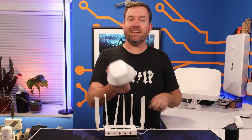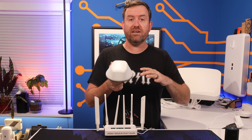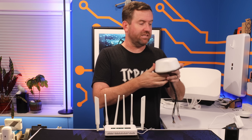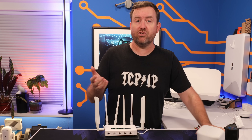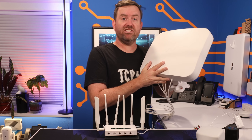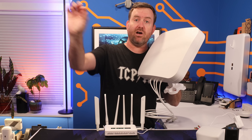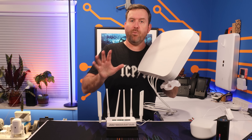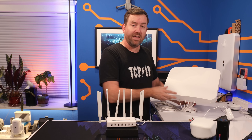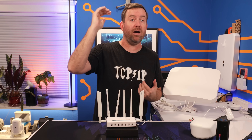This is an omnidirectional antenna. Omnidirectional antennas are great because they can pick up signals regardless of orientation, which is ideal for RVs and vehicles. But for fixed locations like a cabin or a construction site, you might also consider a directional antenna such as this Waveform Quad Pro, which offers greater range because it can focus on specific towers. The point is that you have flexible antenna options regardless of your deployment. If you already own an RV, you may already have an external cellular and Wi-Fi antenna up on top.